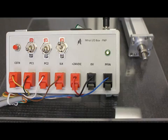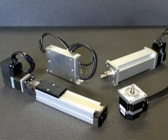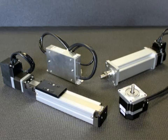Your actuator is now programmed with 4 moves and each move has been tested. You may close the programming software and disconnect the actuator from the PC. Stay with me and I'll summarize the differences between the SCN5 that we have worked with and other Dyadic products. Shown here is an external servo controller along with a sample of the linear and rotary mechanisms that it controls. When preparing I/O wiring for any Dyadic products with an external controller, the RP9120 cable is used. Some of the wire colors in the cable are different, so please consult the SCN-SCL manual before wiring.